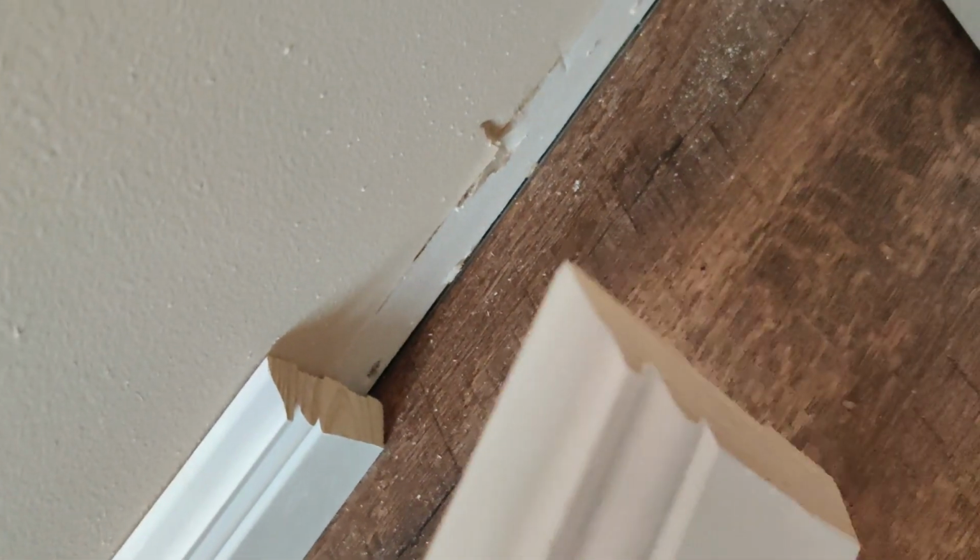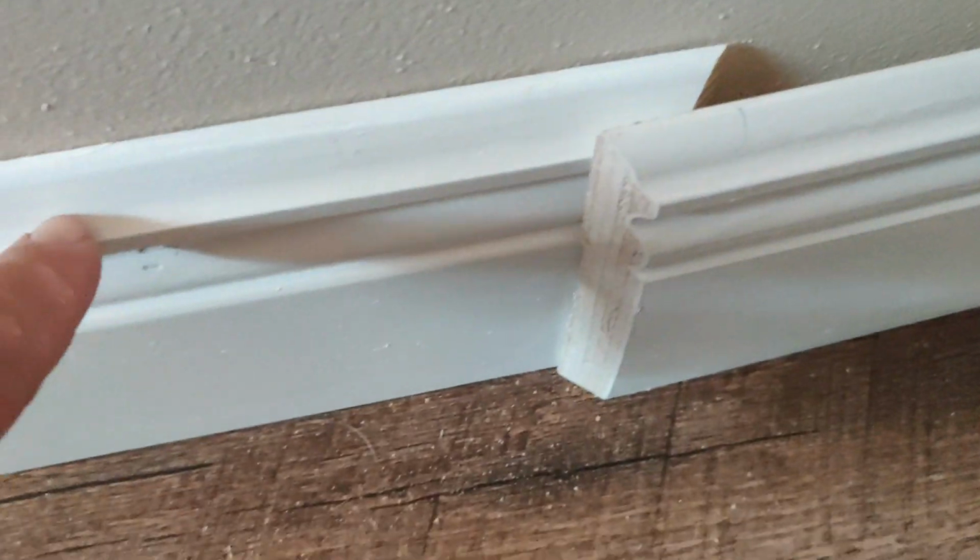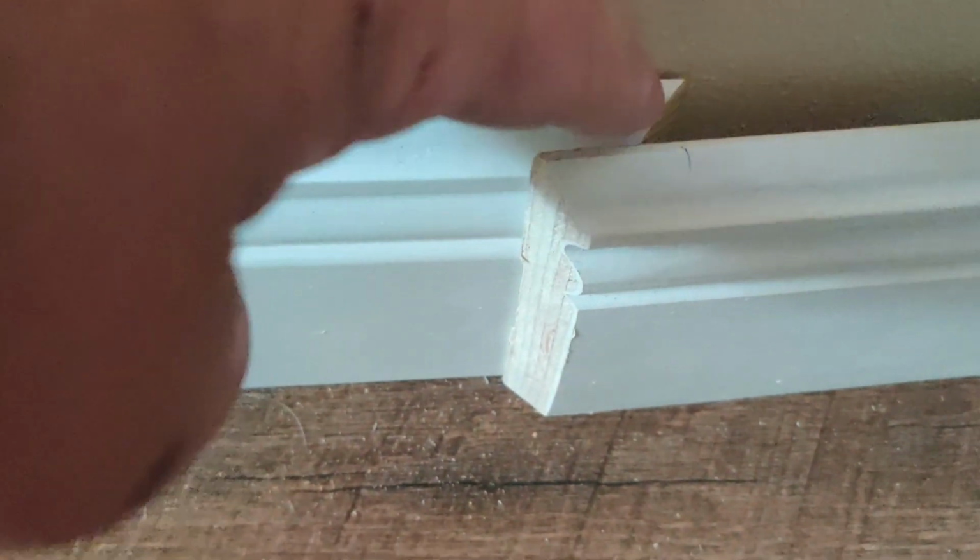Getting back to what I was saying, we're going to put our seam behind where the door closes so that when you walk in you see a solid piece of base there. We just want to push that all the way down there. So one of the things I like to do, if we're not sure on a two-piece wall and they're small pieces, I'll take a piece, we put our 45 on, we line it up there in our end piece, and then we let it hit. This one's nailed in, and that's the last one on the 45.